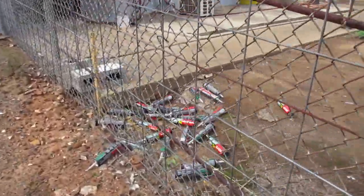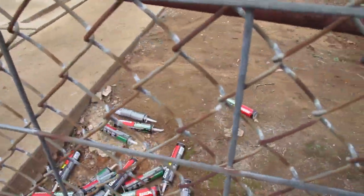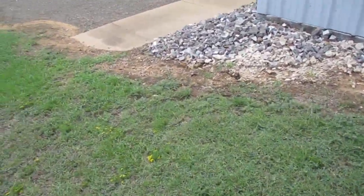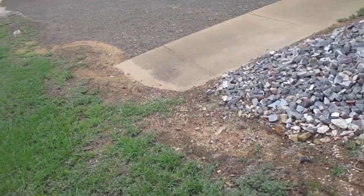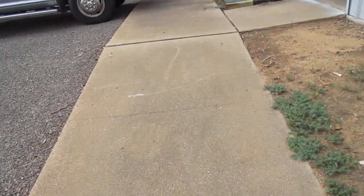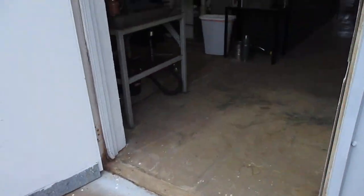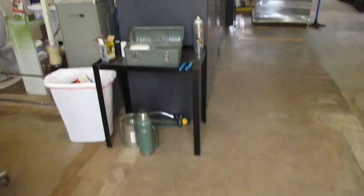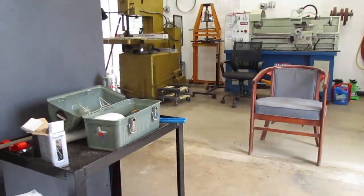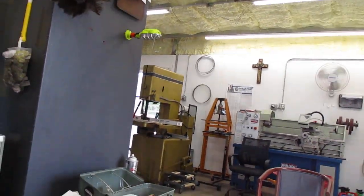See how many tubes of adhesive I went through — it's a bunch. I am loving that battery-operated caulking gun. If you've got to do more than ten tubes of anything, get yourself one — variable speed too, so you can run a real fine bead. I'm laying two beads about seven-sixteenths of an inch, the full length of the block.